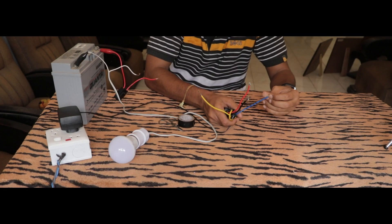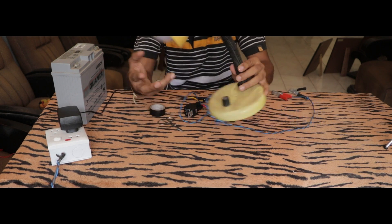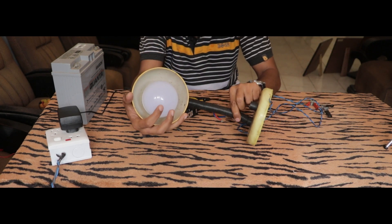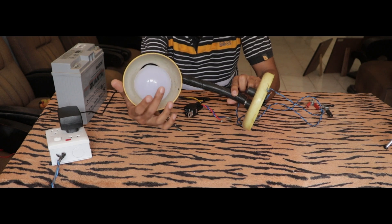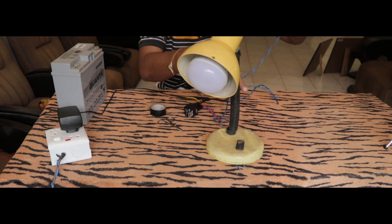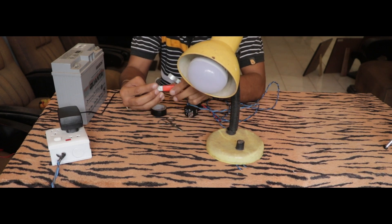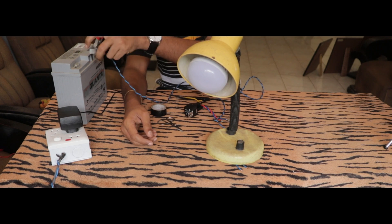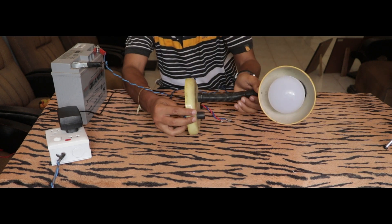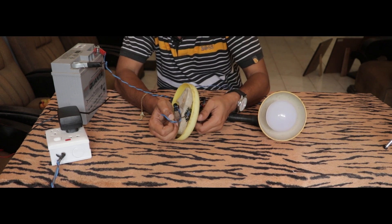That is how you wire a relay without using a multimeter. Here I have a regular table lamp. By replacing the normal main-power bulb with a 12-volt DC LED bulb, I've connected the other end of the bulb with two alligator clips so you can connect it easily — red goes to the positive wire and black goes to the negative wire.